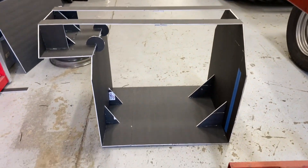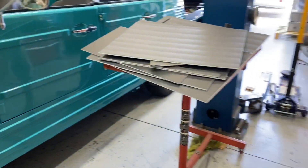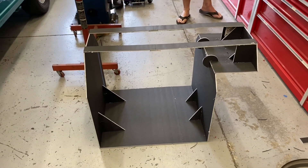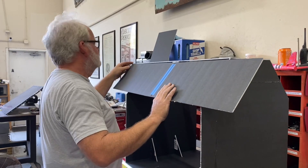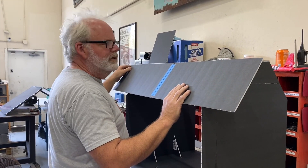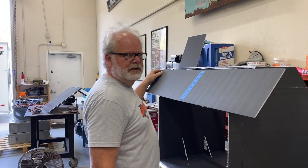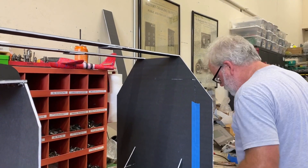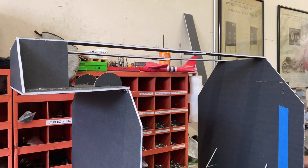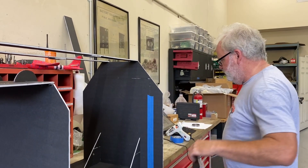So you've got the model over here on the ground. The idea with making it in foam is that you mount the body on the car, and if it crushes, you'll be able to see where it's hitting. The battery box is going to fit 28 batteries — 25 in five rows of stacks and three on top, with long electronics and a contactor. Maybe a DC-DC disconnect.